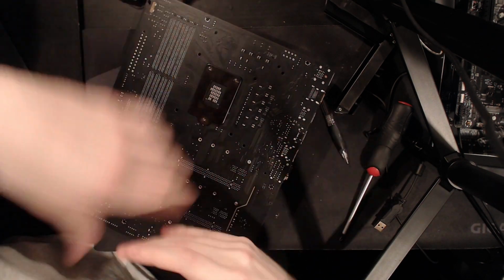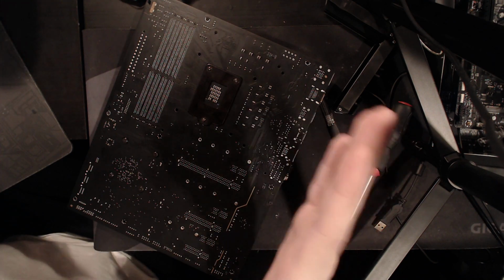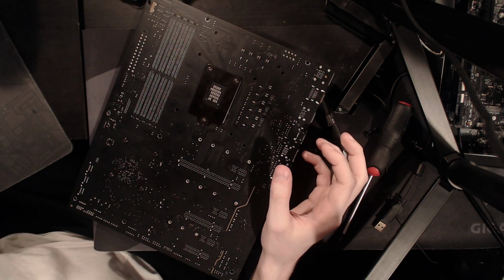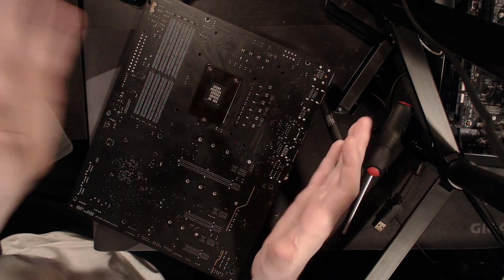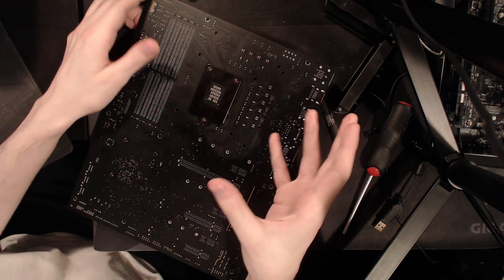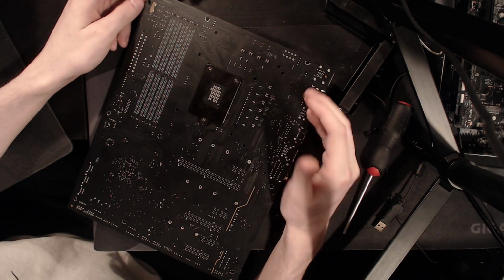And the voltage controller isn't aware that there's a difference in the amount of current going through either of those phases. With the 6617, it actually has logic built into it so that it monitors the current on each of the phases and outputs a sum of the currents to the actual voltage controller, but for its own doubling purposes, it will compare the current going through each phase against the average across the phases, and it will change the duty cycle for the PWM signal depending on which, so that the phases basically hit the same average current.